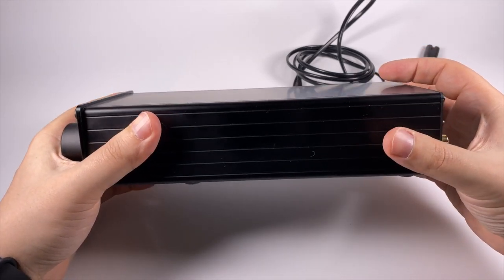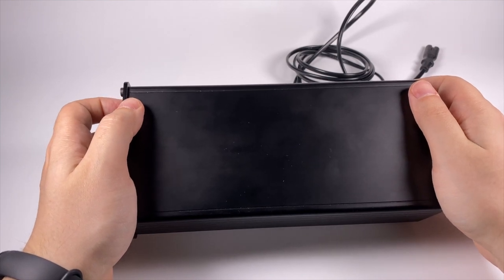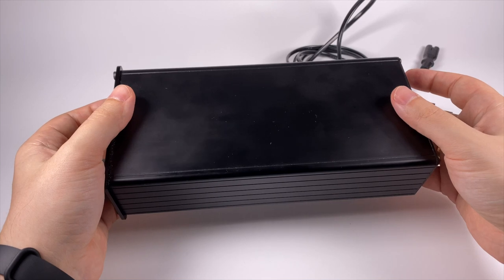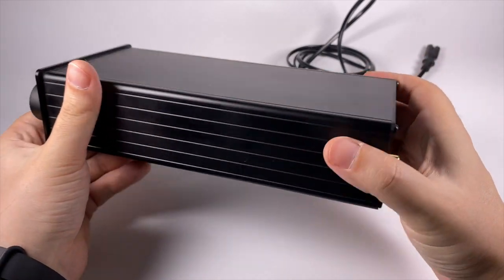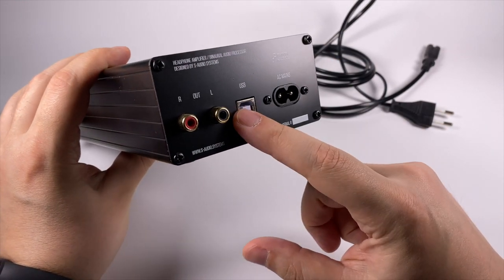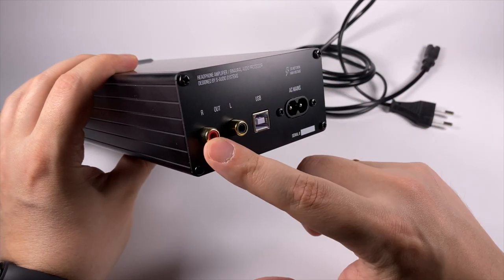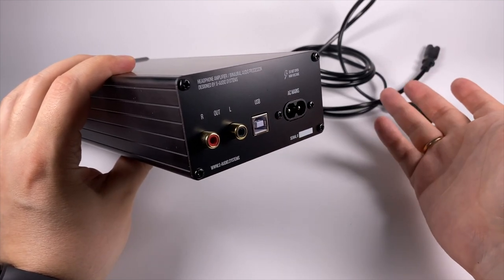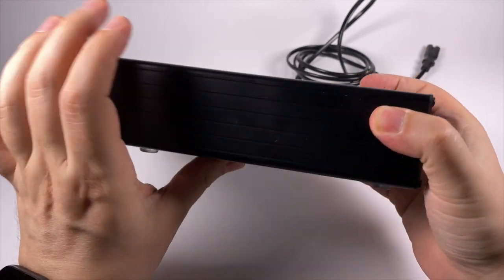For this price you're getting a pretty compact DAC — the fourth version is slightly bigger, but still compact — and capable of delivering 4.7V RMS, so basically universal even for high-impedance models, except a few headphones that are really tough to drive. On the back panel you get an AC input, USB interface, and a line out. If you want to use a powerful amplifier for tough-to-drive cans, you can use it there. The creator also stated that with a special cable you can connect it to a balanced amplifier; they have a schematic for this on their website.